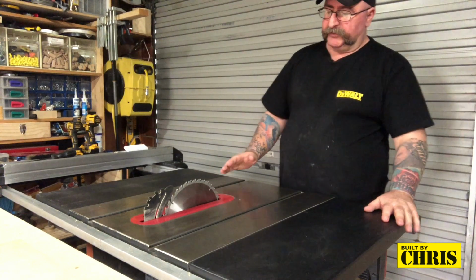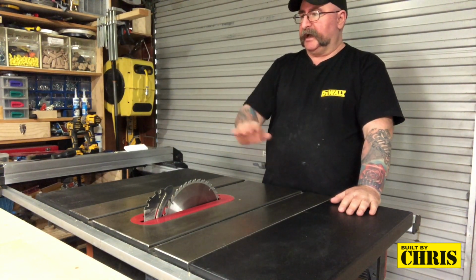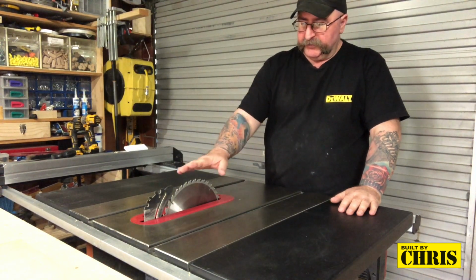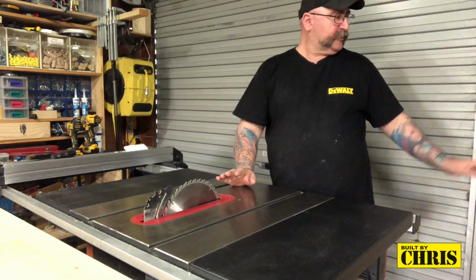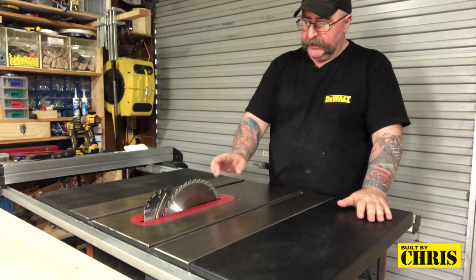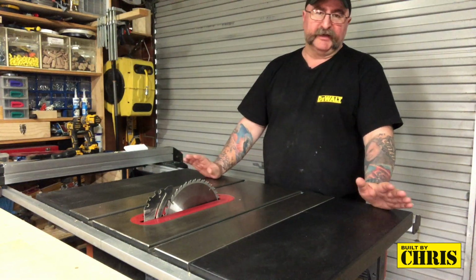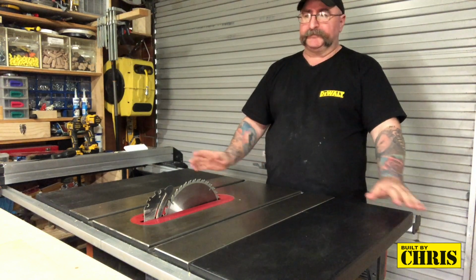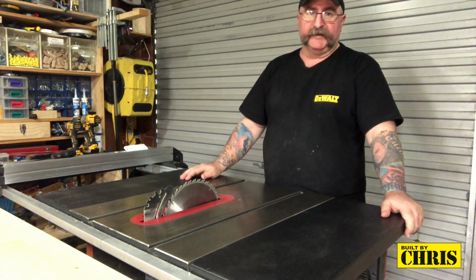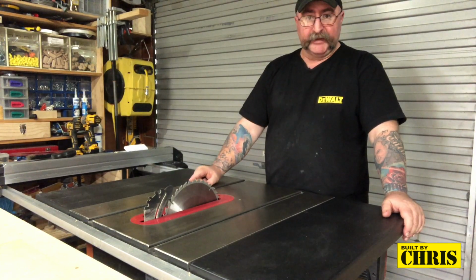And next thing I'm going to do is make the fences. Now I've got a piece of MDF sitting there ready to go. All I want to do is I want to make sure how high the blade is going to be. I'm going to take away the 16mm depth and that'll determine how high my fences are going to be. I've already gone ahead and measured everything up. I'm going to cut them all down to 85mm wide. I'll rip these boards down to 85mm wide and then do a bit of a glue up. So let's go ahead and do that.